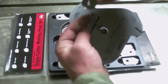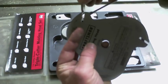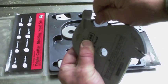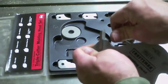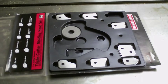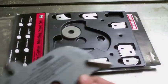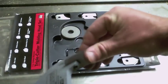As you screw the Allen screw in, it has a tapered slot and it drives the cutter both down and sideways, locking that groove together. Get it snug, then go another sixteenth. I put one in backwards before — not on this cutter, it was on my father's that I used to borrow. It shattered a bit and let it be known it was unhappy. I quickly rectified the situation. What it allows the cutter to do when backwards is move sideways as it spins, causing chattering and rattling. So make sure the blades are sharpened and torqued.